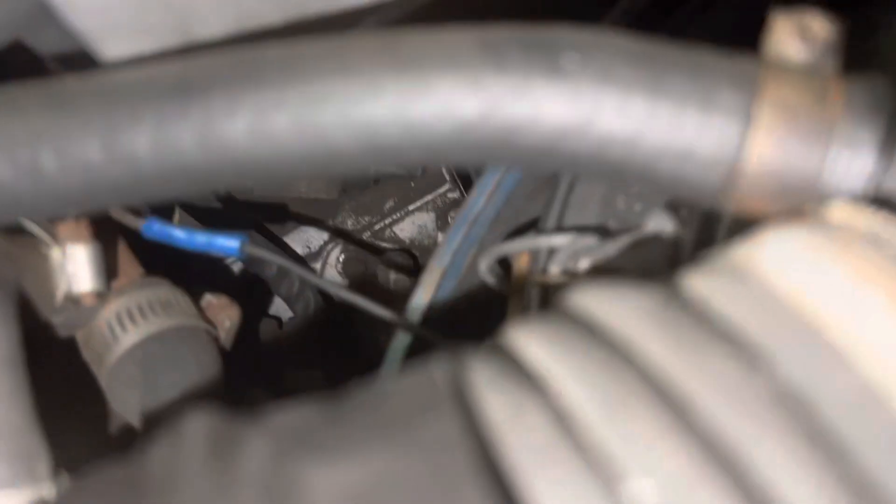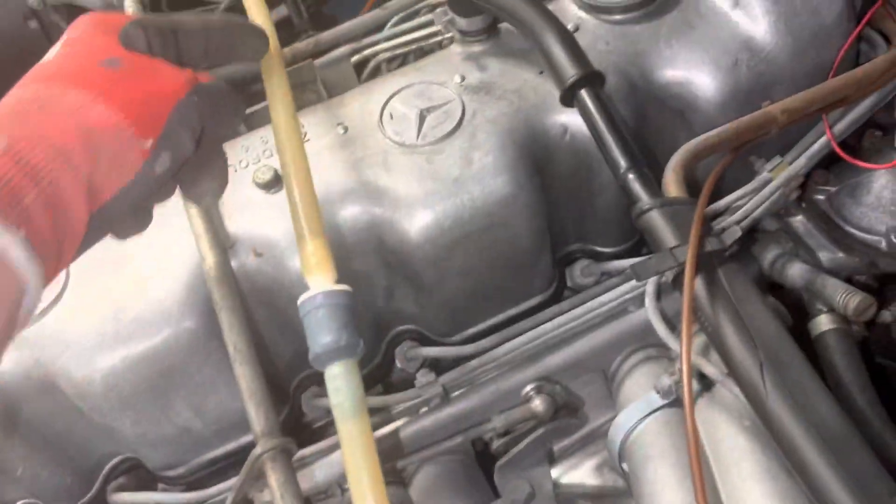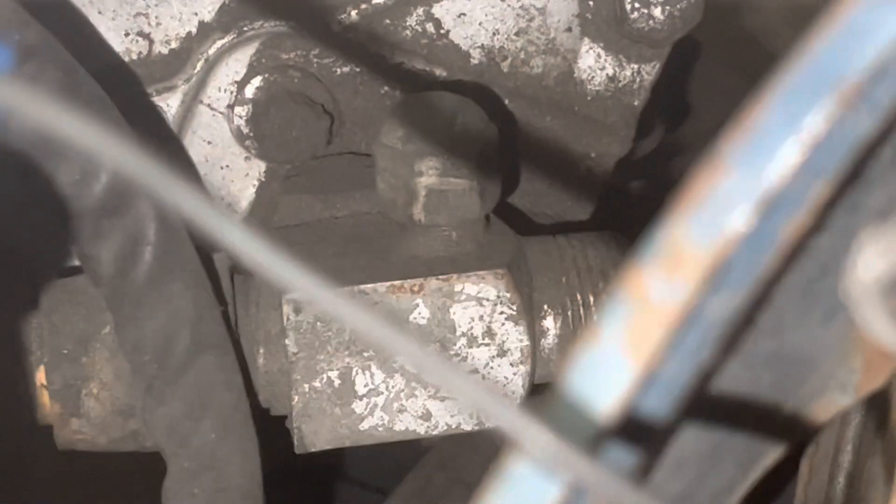You can see the light - I'm getting into the right area. Right there, I'm really close. Somewhere around this line, now it's getting to the point where I need to pinpoint it. I lost my extension tube so I'll have to get another one, but I know it's right down there somewhere around that fitting - it might be the seal on top of the head of the compressor going to that king valve right there.